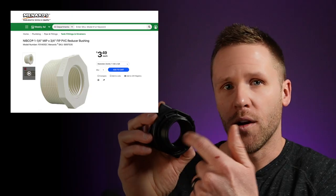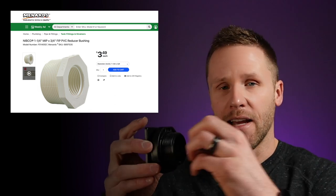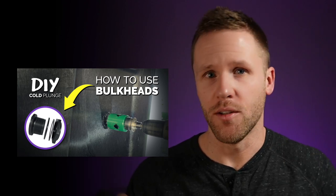If you stick with the standard drain plug, the build quality, even just the weight of the plastic, is less — it just feels cheaper. The rubber gasket isn't as thick, and the outer threads aren't a standard PVC fitting, so you can't get an adapter on top. If you want to do plumbing out of this, you'll need a one and one quarter inch male threaded adapter to screw onto the inside and then connect standard plumbing from there. Ditch the standard drain plug and snag yourself a bulkhead union. If you need help using these, I have a whole video on how to do that below as well.